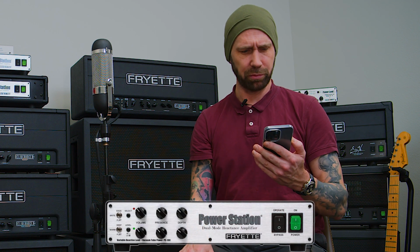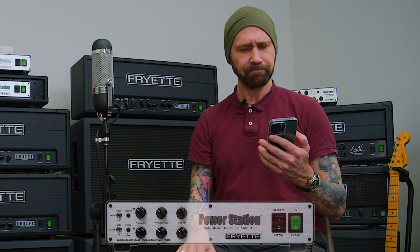Next question is about load boxes. Also, several people asked something in this direction because you also just built a very successful product, which is not only a load box. So why do different load boxes sound different, and what makes a load box sound great or sound right? In a nutshell. Well, I have to approach that question the same way as the tube question because the load box doesn't really sound. What it does is it presents a load to an amplifier that sounds. So what makes load boxes sound different is because they cause the amplifier to behave in a different way.